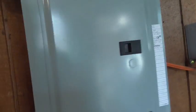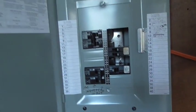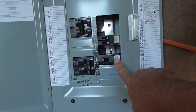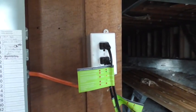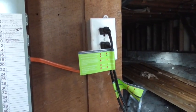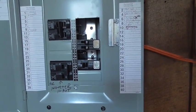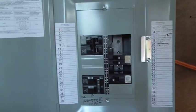I've got it wired down into my temporary sub-panel. In the sub-panel, this is where I'm going to be putting in all the circuits for the house that I want to run. What I've done temporarily is I've got it wired into one external plug, which, if we had a power outage, I could actually plug in the fridge, plug in the freezer, TV — whatever we want to run. And as soon as I can get off-island and get some wire and receptacles, I'm going to be wiring the rest of the circuits upstairs. But for right now, we've got emergency backup power.